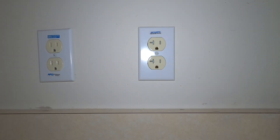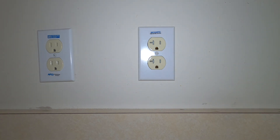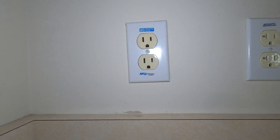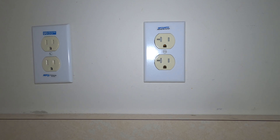When you have a dedicated 20-amp circuit for a microwave — or it could be for an air fryer or something that draws a lot of current — on our microwave I measured it and it draws 17 amps. So it needs its own 20-amp circuit, or at least needs to be on a 20-amp circuit with a 20-amp receptacle. This is a dedicated receptacle on a dedicated circuit — the only receptacle on the 20-amp circuit, reserved specifically for a microwave or air fryer. They draw so much current that if there's something else on that circuit — like a toaster and a coffee maker — they can't be run at the same time or you'll overload the circuit. That's why I went ahead and installed dedicated 20-amp circuits: one for the microwave and one for the air fryer we don't even have yet, but I'm planning ahead.